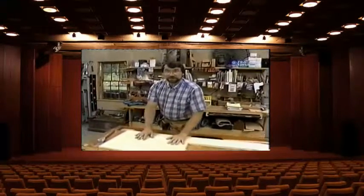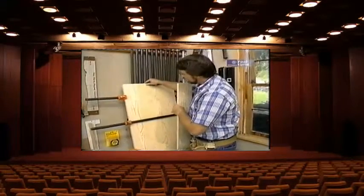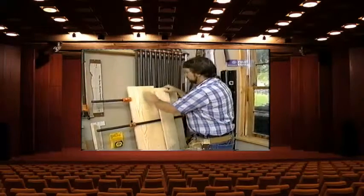To get started, I glued up some panels — here's one for one of the sides, here's another side panel, and this large panel is for the seat. The first thing I want to do is scrape off the excess glue and lightly sand both sides.